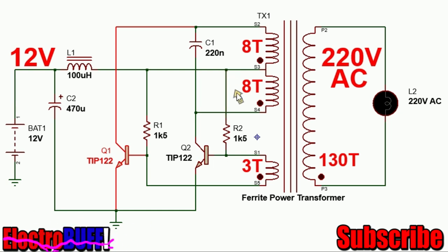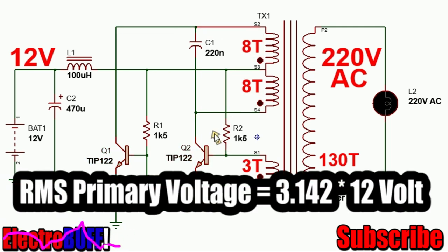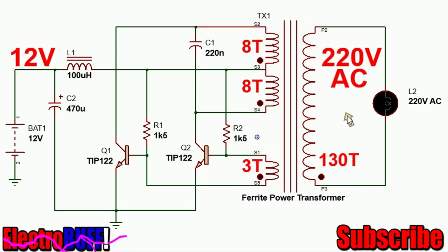The frequency is determined by the inductance of the primary winding and the choice of transistors used. The voltage across the entire primary winding is π times the input. With 12 volts, you will have an RMS voltage of about 27 volts at the primary, so the transformation ratio should be about 8 to get 220 volts. With 16 turns on the primary, you need about 130 turns on the output to get 220 volts AC. The output is a pure sine wave because the capacitor-inductor resonance circuit regenerates a pure sine wave across its terminals, and with this you can power devices such as fluorescent lamps or even devices that operate on switch-mode power supplies.